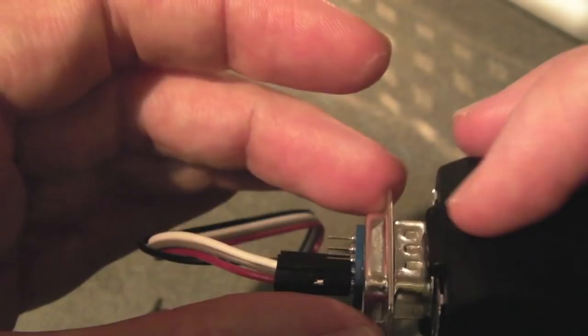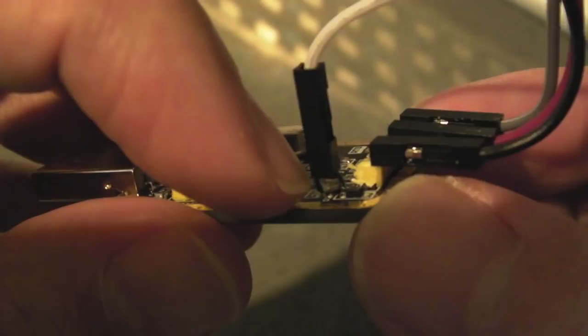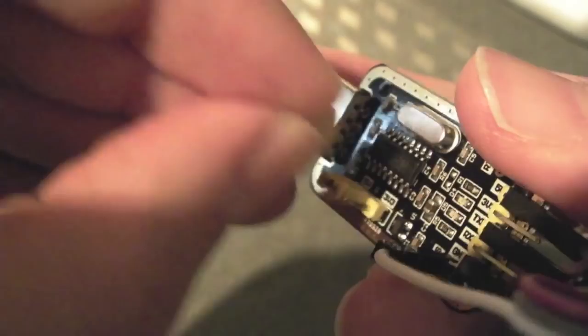I used one of these panel-mount in-line connectors so I could just plug on there without soldering anything, just the single pin header. It would have been nicer if they'd put those pins next to each other with a two-pin header to make it more modular. There was also an extra jumper that shipped with it — RXD and TXD were joined, which is a common technique to test serial devices. You plug in, write data out, and it echoes back.